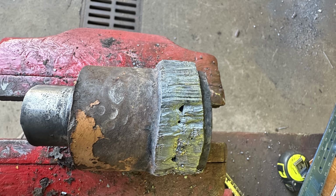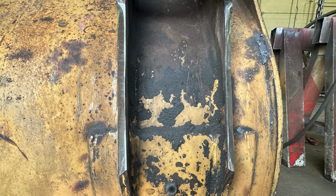Let's look at the ground down bevels. So here they are, all nicely ground down. I left, I don't know, maybe a knife edge to a 32nd on it. It wasn't really much. And this is my preferred method. Now, I was not going to weld these with a backing bar. I welded it open root and just ran it hot with kind of disregard for what the inside of the weld looked like. And that's because I ground down the inside and then welded it. The inside is a little bit over maybe 1/16 of a gap, and you can see how flat that was. And again, that was all achieved with a pretty rough torch cut and about 5 minutes of grinding total for both sides. It's not that hard to achieve pretty straight bevels with just a torch and a grinder, or just a grinder for that matter.